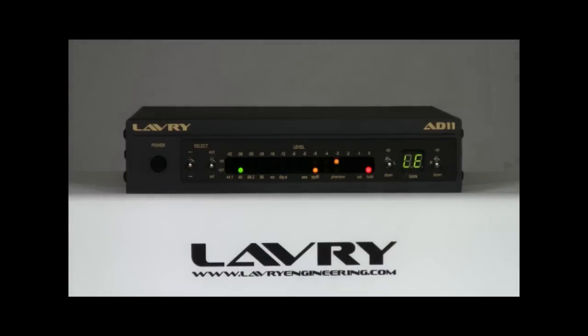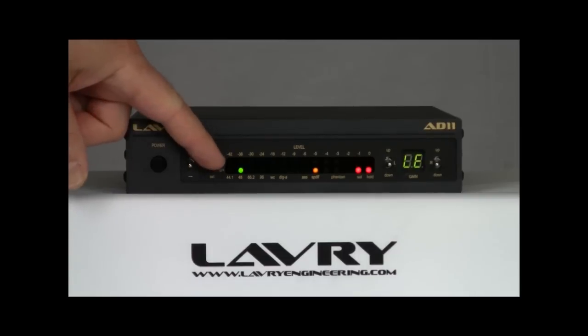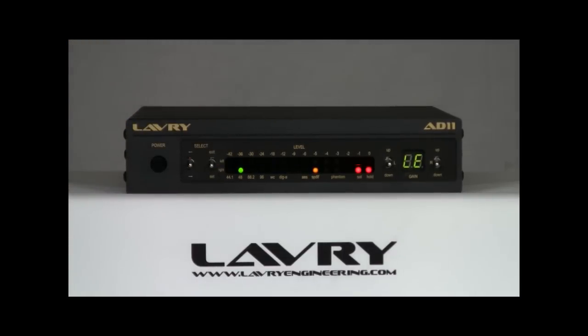The other setting that has individual left and right indications is the Lavry exclusive soft saturation mode, which is a digital emulation of analog tape saturation. The two main advantages of this approach to peak level control are: the signal is completely unaltered up to the threshold of -6 dB digital level, except that it is 3 dB louder, and there are no attack and release time constants, as in the case of traditional compression or limiting.